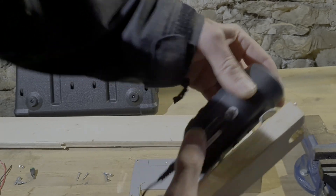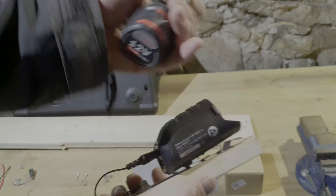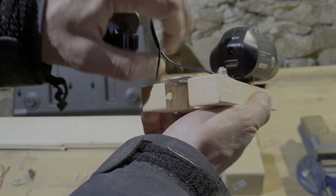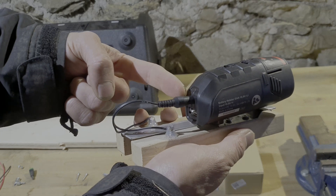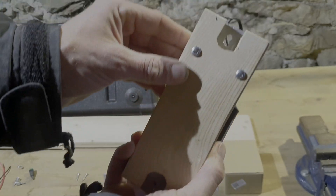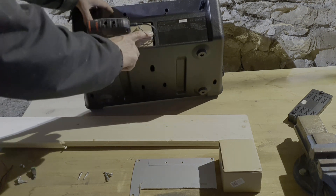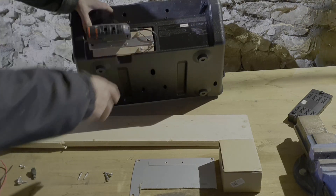So what is it? Well, you need your 12 volt Bosch tool battery — or you can probably do that with a different brand — and you need the corresponding adapter. This one has a USB output, which we're not going to use for this project, and a 12 volt output, which is the straight output of the battery. The battery brings 12 volts to this connector, the connector leads into these metal poles — they are screws actually — and these screws bring the contact. We're just going to replace the original system with this and then using M4 screws we can hold it down, and that's how these connectors bring the juice to our unit.